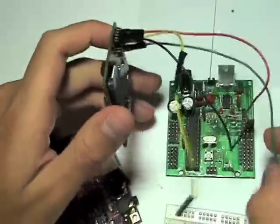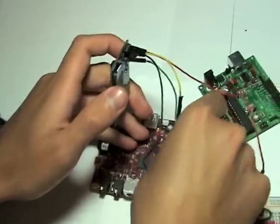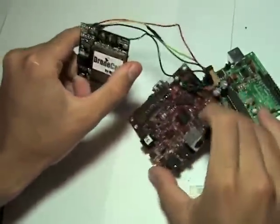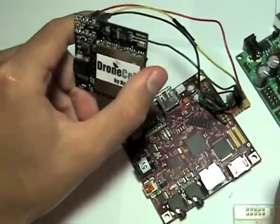Or let's say I didn't want to connect to the RoboDuino — let's say I wanted to connect to my BeagleBoard. Similarly, I would just plug it straight into the TX and RX lines that I drew out, connect power and ground. And now my BeagleBoard would be able to call, text, go online, transfer information, really do anything.